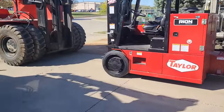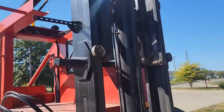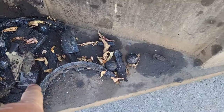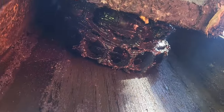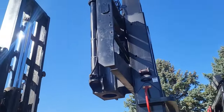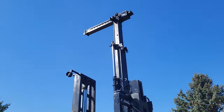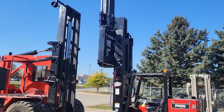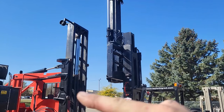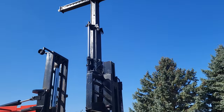We are getting ready to pull out that mast rail right there. The bearing exploded — because that's all that's left of it right there. So my goal is to pull this rail out. I'm going to use this 40-60 rigging truck, pull it out. It's going to be fairly tight on tolerances. You may think that it can't clear from there to there based on this distance — I'm going to show you how we can verify that.